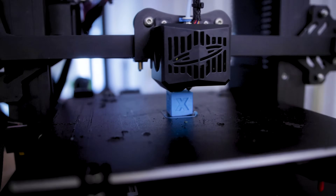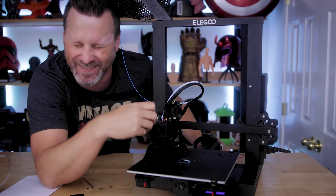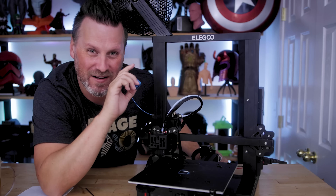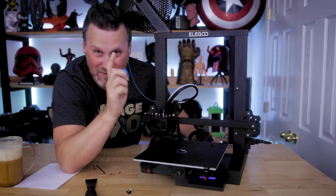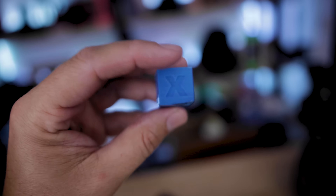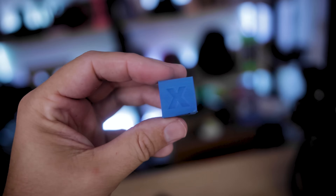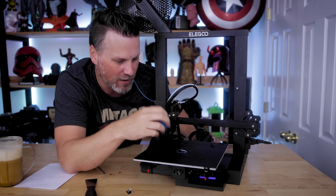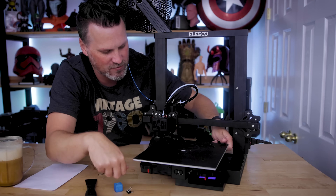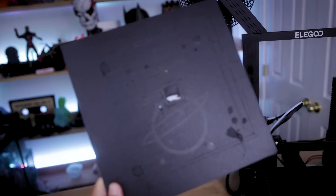I'm going to try and print a calibration cube and see how it turns out. So 30 minutes later, this cube has finished printing — and this is very quickly becoming a lesson on how not to do something versus a tutorial on how you can fix your build plate. This is quickly becoming just 'don't attempt this.' I just pulled this off of the build plate and a good portion of the spray-on peel and coat just came off with the cube. I also got a little bit of lifting in one of the corners, so it wasn't exactly adhering.